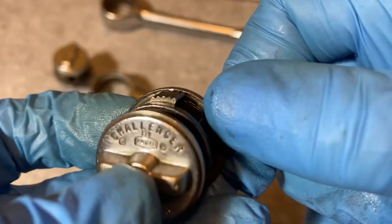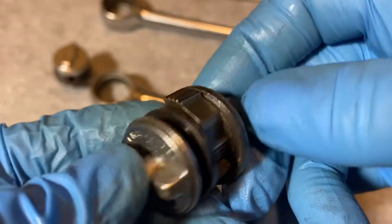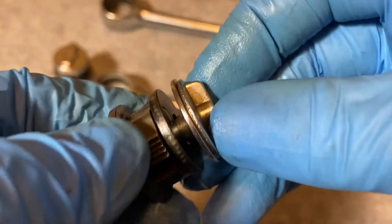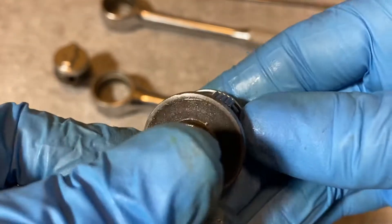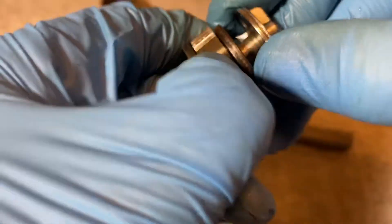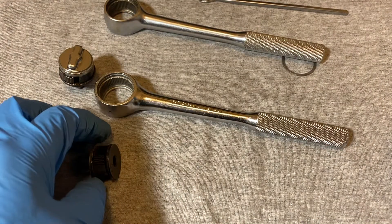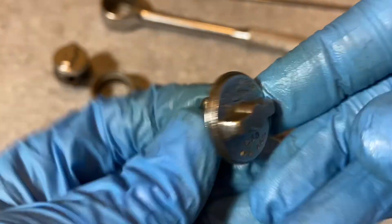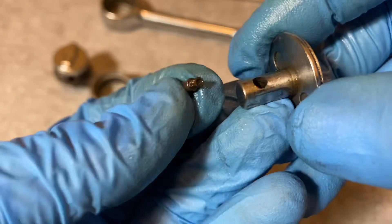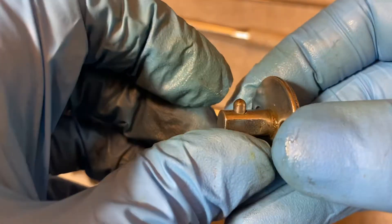These have five teeth on the pawl per side, which is pretty good engagement. To take this apart, I just press down on the pawl — the pawl is sticking up — and that presses the plunger down, which lets me ease it out. Here's the switch with the plunger, and it has a spring underneath the plunger. The plunger is a little bit hollow — semi-hollow — and goes in there like that.